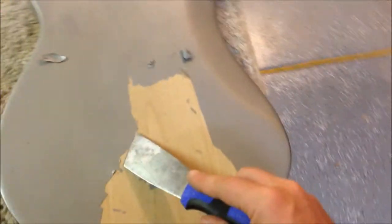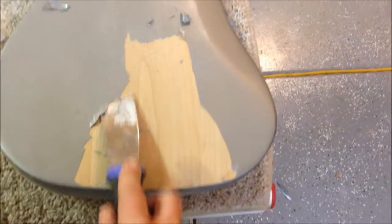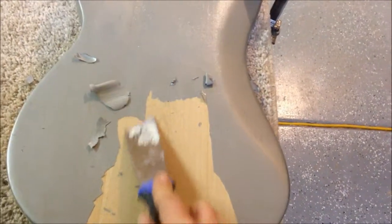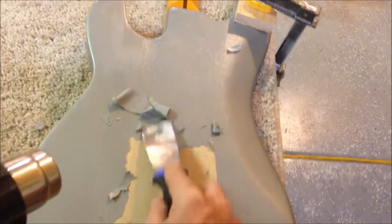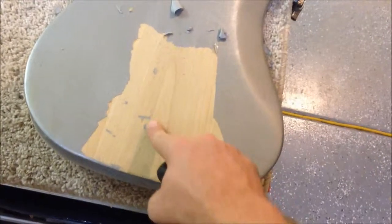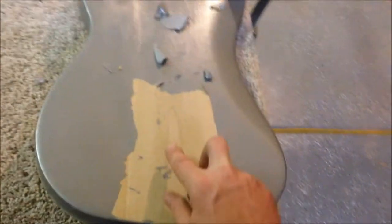I think I got it a little too hot there — I'll just pull it here and continue. I'll continue to do that until the whole body is stripped for the most part. These little leftover pieces are where I started catching underneath some of the grain and just let it go. I'll come back with my sander and hit that, then use those blocks I showed earlier. In the meantime, I'm just going to continue scraping all this finish up and then move on to the sides as well.